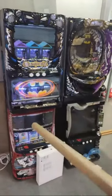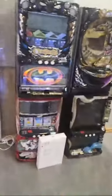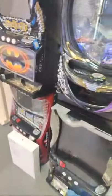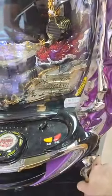Yeah, if you guys want to see something cool, check these puppies out. These are Japanese slot machines and a Japanese pachinko machine, Batman themed. Been wanting to hook these up for a long time, but we just haven't gotten to it. But the cool thing is this can use the servo, or it can use a relay to control the buttons. Then you could also do a servo to control the pachinko side. So we'll get to it eventually when we're done with the templates for the servos and the relays and the motors and all those things, because then you can really just use them for anything, like even a solenoid. You could just glue a solenoid here and the solenoid could do the clicking, or even this could maybe be done with a solenoid, but you kind of want more finesse here, so you just use a motor. But for some things like a slot machine, you can just have three solenoids, four solenoids. But yeah, we'll get into that eventually.